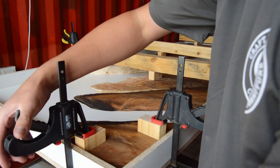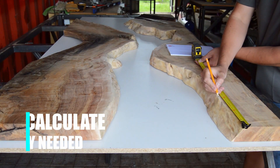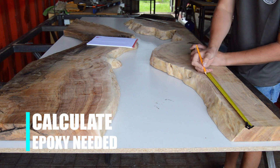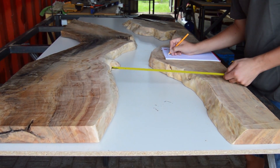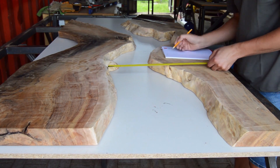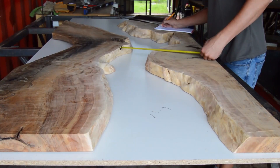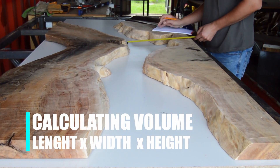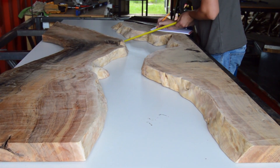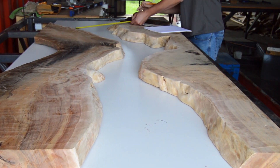Calculating epoxy — we're still using the same methods to this day. It's a calculation of length times width times height. What makes it challenging is the slab is obviously not straight. If you want to learn more on this topic, you can go onto our channel and scroll through the videos — there's a video that goes into detail on how to calculate epoxy. We did get more accurate over time as you learn the curves of the epoxy, the live edges, and exactly how to measure. This is something you will definitely get better at.